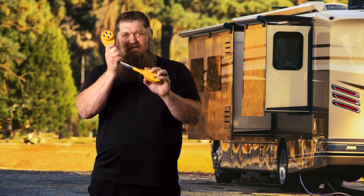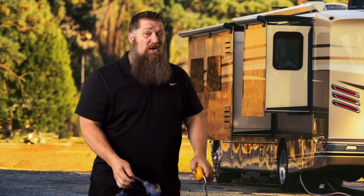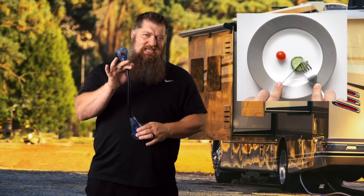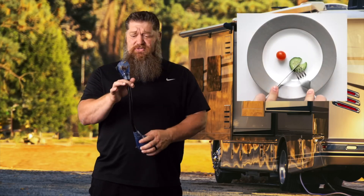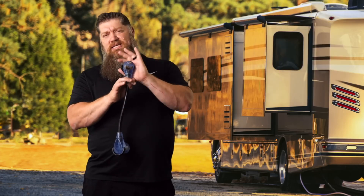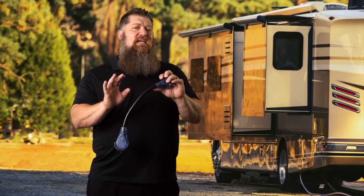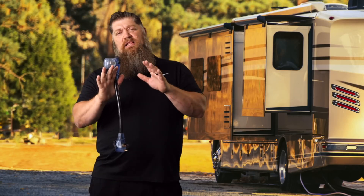The reason I want to talk about this is it's the one we have the most problems with. You are used to 50-amp service, and whenever you go over to a 30-amp service, you are limited — it is like putting yourself on a diet. So when you're using adapters, especially reducers, what you really need to consider is how much power you're drawing. I hear it a lot: people say as long as you only run one AC, you're safe. That is not true.